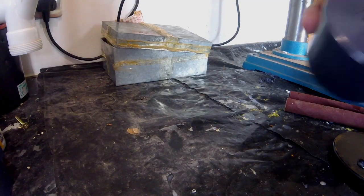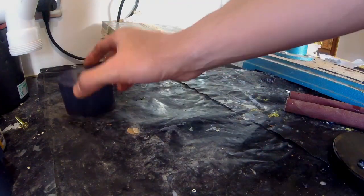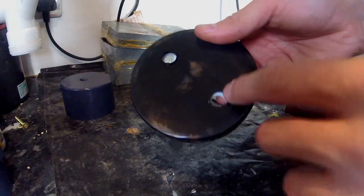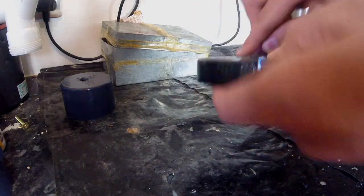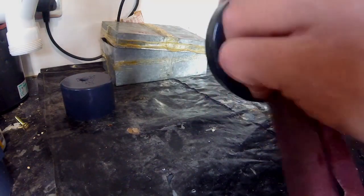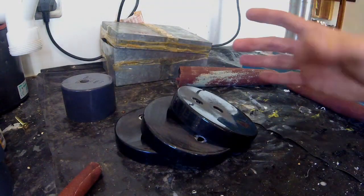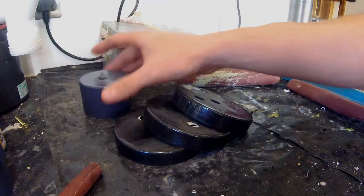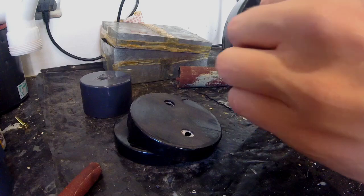So we've used a 13 mil drill bit and we've got a hole in this. We're going to put a uni seal in that hole for the gas pipe to come out of the digester and then into the scrubbers. We have again some 13 mil holes drilled in there through the back. So we're going to give that a little bit of a sand, make that smooth, and then put in the uni seals. We now have our three lids to the scrubbers, both with two holes in, and we have this one for the gas outlet for the main digester. So we just pop these eight mil uni seals into there.